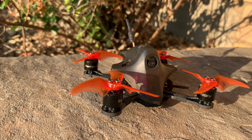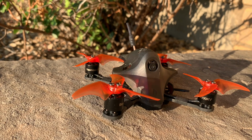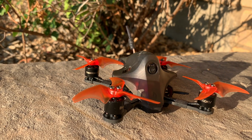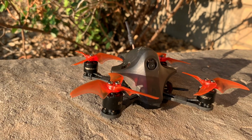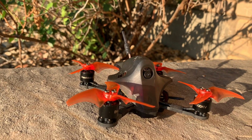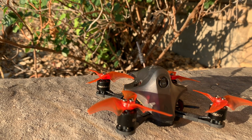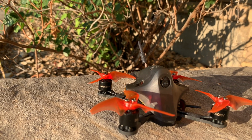As far as tuning, I didn't change anything from the Betaflight defaults for the 4.2 Betaflight version. The only thing I did was turn off DMIN, and I also turned on RPM filtering after I flashed the JESC firmware on the ESCs. There was only the slightest bit of prop wash when I tried my hardest to bring it out on purpose. So I could probably do a little bit of tuning, but it really flew great without even touching the PIDs at all.